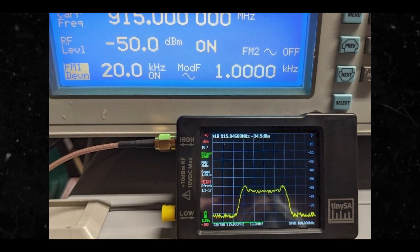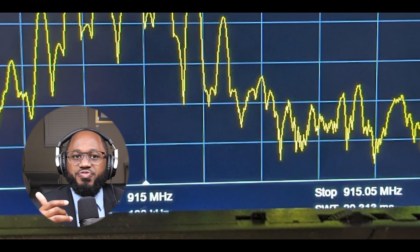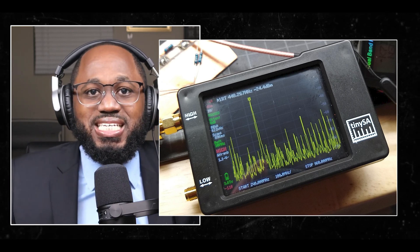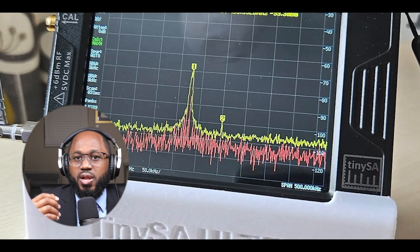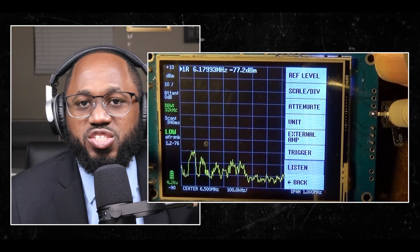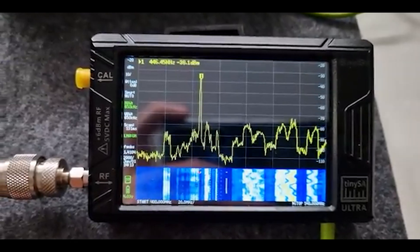Using the max hold feature, you can see the shape of Wi-Fi signals more clearly, which helps differentiate them from other signals. The TinySA can be used to observe various wireless networks simultaneously, including Wi-Fi, 433 megahertz ISM, mobile phone, and DECT traffic. Disabling spur removal in the configuration settings helps detect short bursts of Wi-Fi activity more effectively, and using online mode allows you to see which transmitters are active in real time. However, the TinySA's sweep speed may be too slow to capture all signals consistently, especially for fast-changing technologies like Bluetooth and Wi-Fi. You can build a picture over time using features like the max hold.